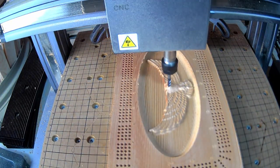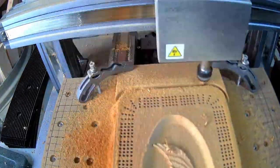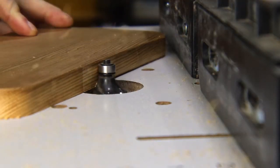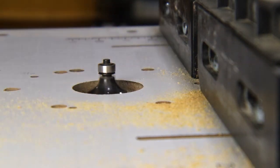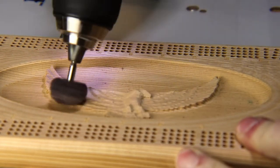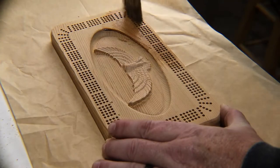This one is all ready to cut out, and unlike the last one, I'm going to do the cutout with the CNC rather than the crosscut sled — mostly because I wanted to round the corners of the board. After cutting it out, I decided to give the top edge a little round-over with the router. I could probably do this step on the CNC as well, but it may just be quicker to use the router for this small step. I used a flap wheel to remove any rough spots, then went over it with a mini brush scouring pad to get all the little burrs out. I also sanded the top surface a bit, and for finishing I'm using the same 2-in-1 stain and polyurethane I used on the puzzle easel.